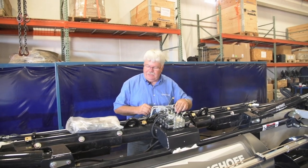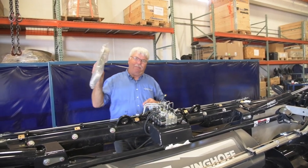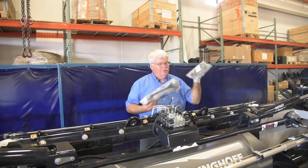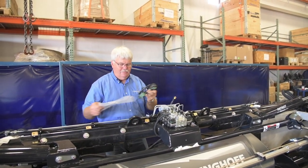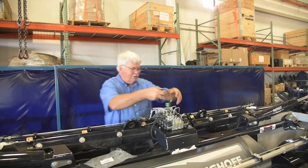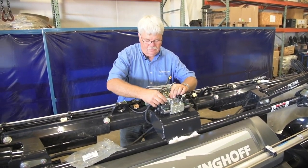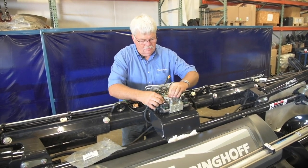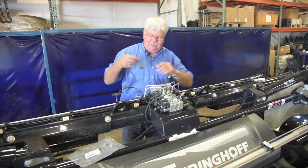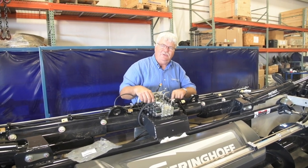While we have space to work, we're going to add the electrical connections for these valves. In the kit you'll find a bag with different wiring components. Inside that bag are two wiring harnesses — very simple, they just plug right onto the valve. Push the wires so they'll be out of the way for when we hook up the steel lines later, then take a screwdriver and tighten the retaining screw that holds each connection to the solenoid valve.